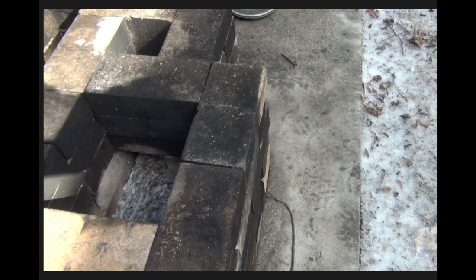This is not the final stove - it's half broken down. That riser goes up two feet. I'm just breaking it down and showing you midway through the construction so you can see the internals. The riser's too small here because it's being taken apart. The air at the bottom is unplugged, and the air just comes across the bottom - just nine inches, one brick - and then goes up the riser. Even with one little channel across the bottom, the sticks in this hopper still wanted to smoke and smolder. One time when I took the top off, it all flashed - everything caught on fire at once because it was given the oxygen it needed, and it's not going to work.